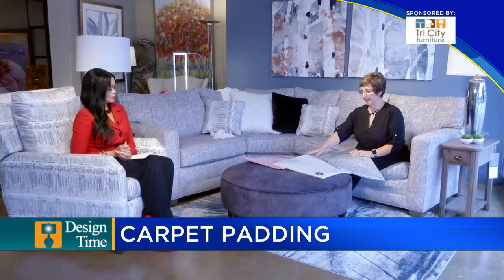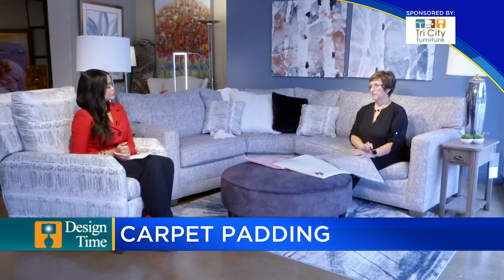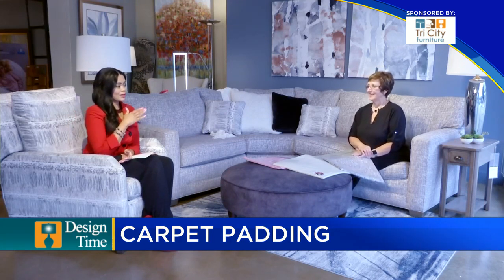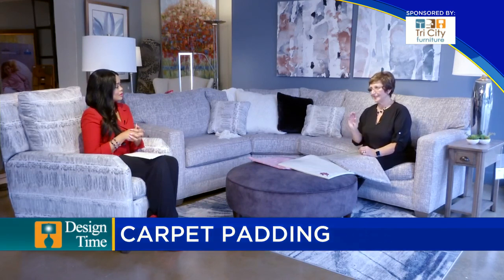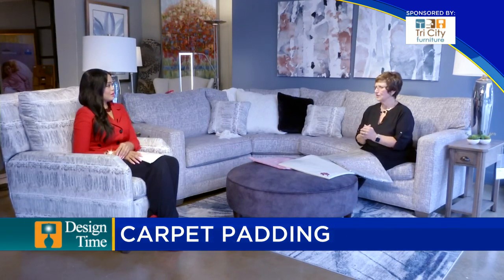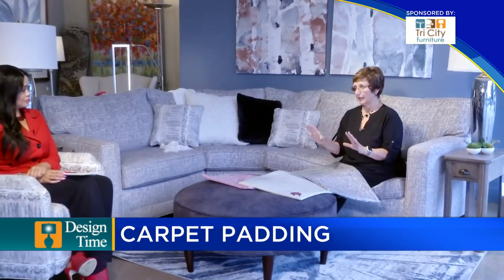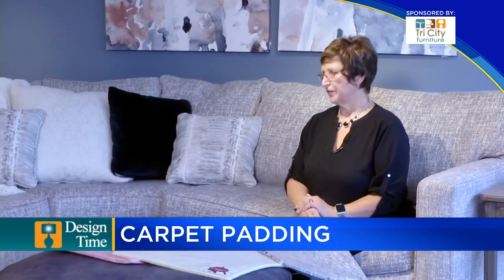Many of these newer pads will actually warranty on stairways and hallways, which many carpet manufacturers eliminate warranty on due to heavy use. There are so many pads out there. To know you're getting good quality, always ask about the density. The height factor will be less than a half an inch. I've had people ask for double pad — it gets really squishy, but it will not hold up. You do want to follow those specifications, and the stores know what they are.